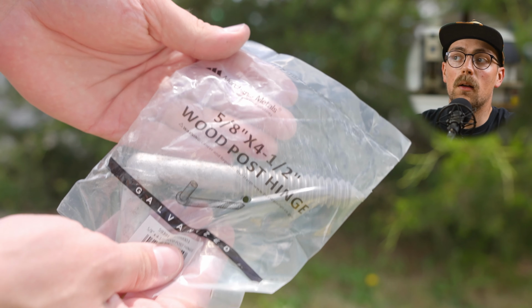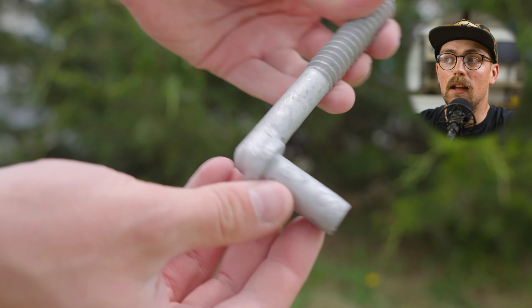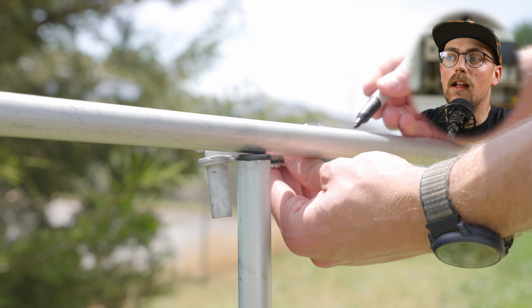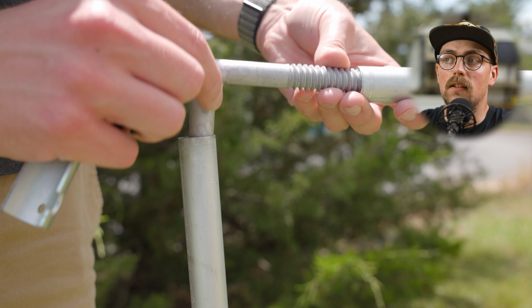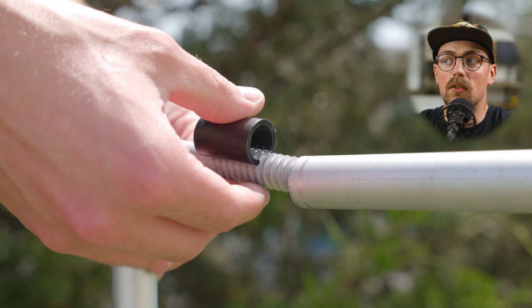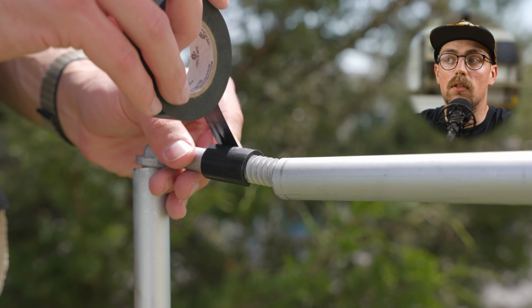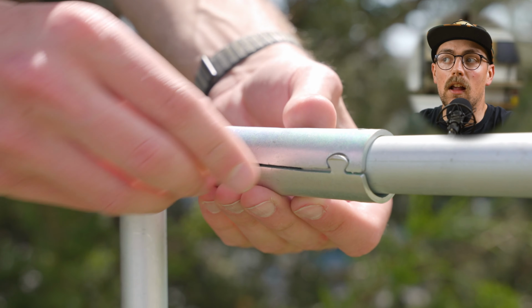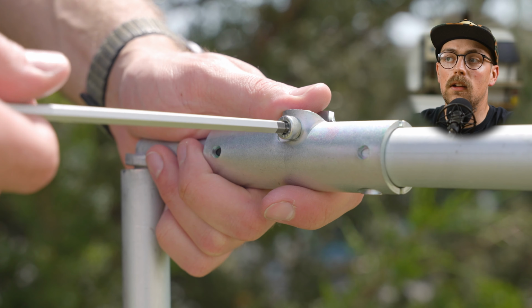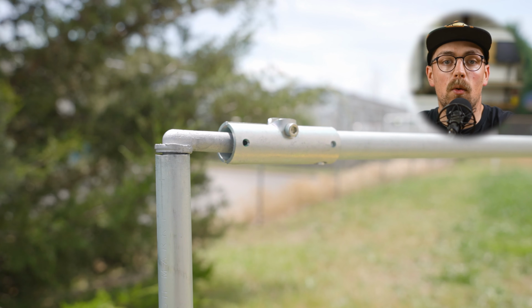Super cool. This next idea comes from Stuart, and this is great for gates or arms that you want to swing up and down and latch. He used a 5/8 inch lag screw hook and secured that to the build. Basically, I just put it in place and measured, made some cuts, and then placed the lag screw in place where it's going to latch into the conduit. And then because it's smaller in diameter than the 3/4 inch EMT, I just used the 3/4 to 1/2 inch adapter shim and then a couple layers of electrical tape. Then I used a coupling to secure the lag screw to the EMT conduit, and as you can see, it creates a latch that you can drop down in that vertical post, and it works really great, like I said, for arms and gates that swing up and down.